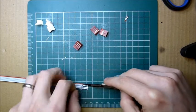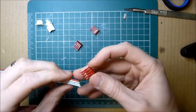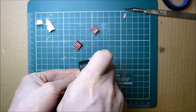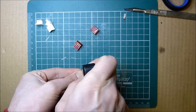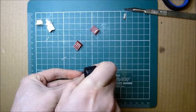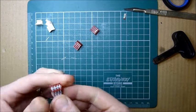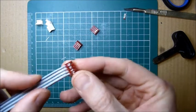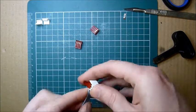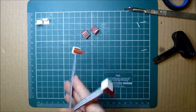You can probably get away without feeding these little bits out. But with the IDC connections, I'm always a little bit nervous about how much insulation is in there - whether there's the right amount, because it's all pretty precise stuff. It's meant to be machine applied using the right tools, so as soon as you deviate from that you're risking a bit. Just push those in. There's a slight indent as they go in. There are two ends - do another two.